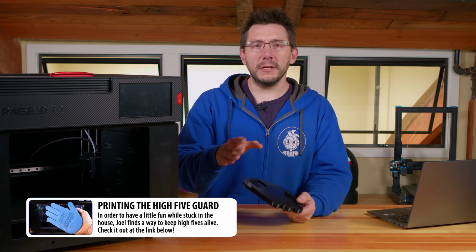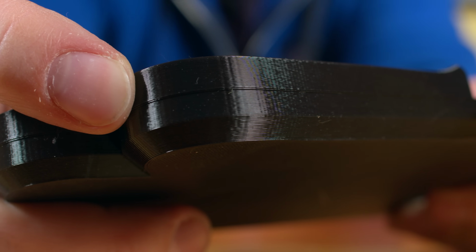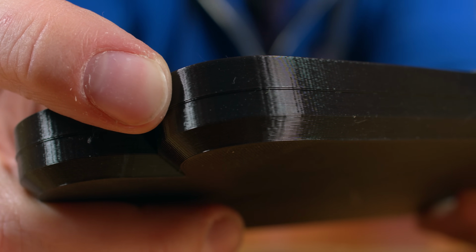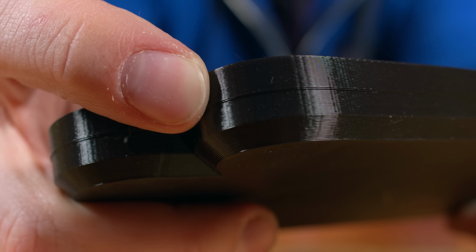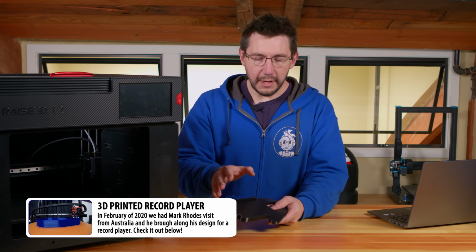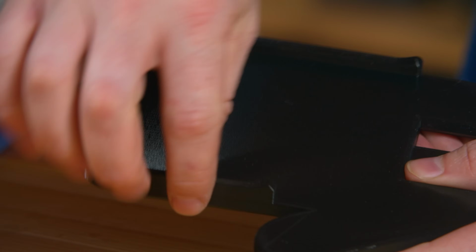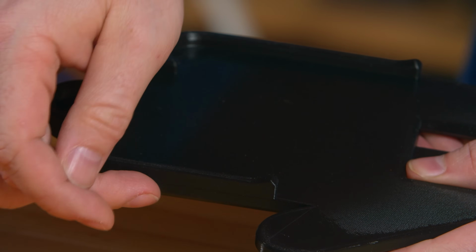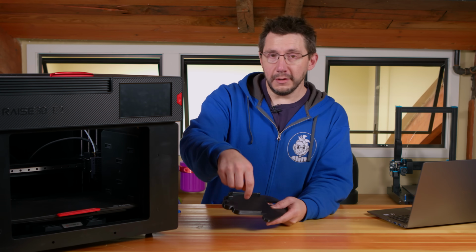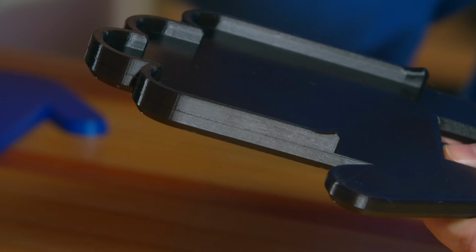It is displaying something that other printers are showing. If you look right there, you can see that there is one tiny little continuous layer imperfection, and it happens to line up with the top layers here. We saw that with the record player episode. One of the things we thought was because there's infill right here, and then this doesn't have nearly as much in it. That infill contracting is pulling that sidewall in, and then when these walls go down, it's a little bit over it. We heard some of you say you wanted to look into that when we talked about it. If you want to see that, please leave a comment down below. I would love to explore why this happens and ways to mitigate it.